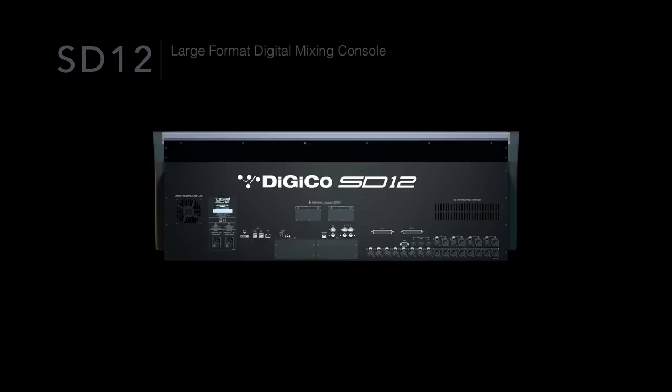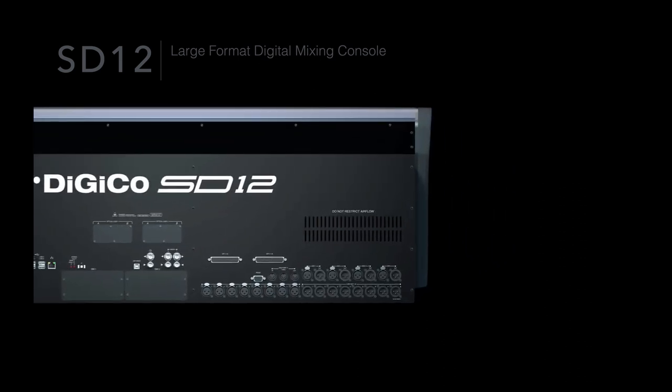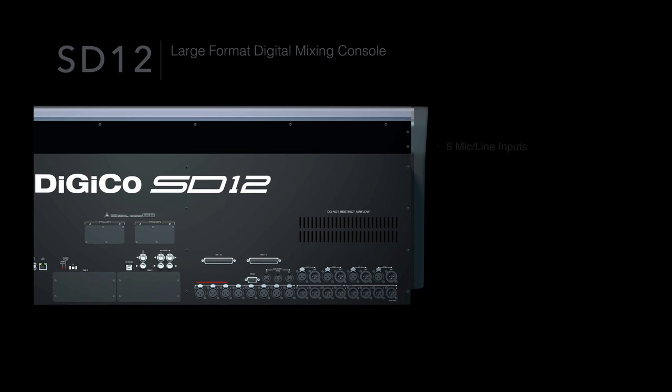All right, let's take a look at the back of the console as before to show you how audio gets in and out from here. First things first, we have our 8 mic line inputs, 8 analog line outputs, and 8 channels of AES in and out over 4 pairs in and 4 pairs out of AES. We also have 2 MADI ports. Each of these MADI ports are 64x64 channels at 48K, and we have 2 of them, which you're going to see. We're going to use these in a minute to connect to our stage racks.